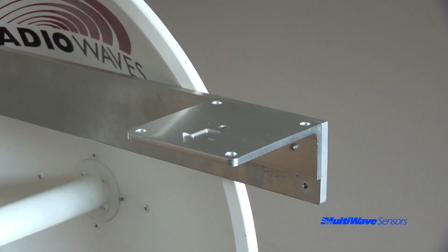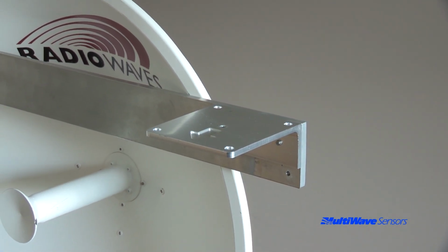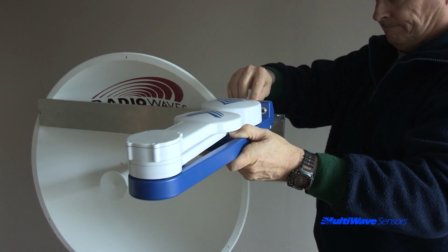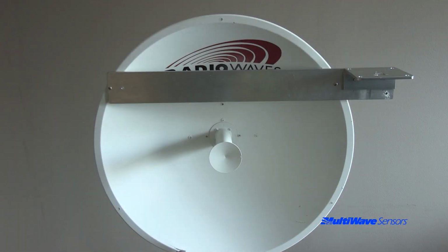It is important to mount the adapter in such a way that the arrow is pointing in the same direction as the dish so that the tool can properly detect its position relative to the dish. Try to keep the bar as level as possible to keep your tilt reading as accurate as possible. Please ensure that you're properly tethering the bar according to climbing safety regulations.